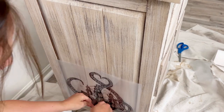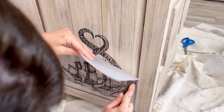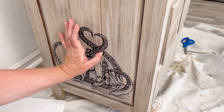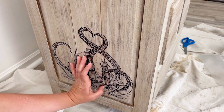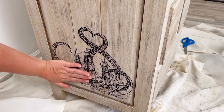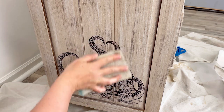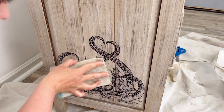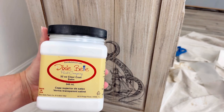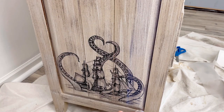I continue applying the transfers where I want them. Here I'm using my fingernails to split the transfer in the creases — you can also use a razor blade or even scissors. Now I'm using my sanding sponge to go over the entire transfer on the piece everywhere I put a transfer, going over lightly to make sure there are no bubbles and no halo. It'll make it nice and smooth so I know it's adhered properly. Then I take the last step of putting my clear coat on to seal the transfer, and I seal the entire piece one more time.